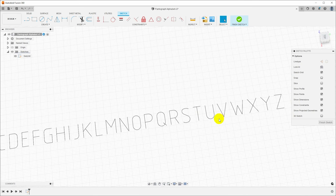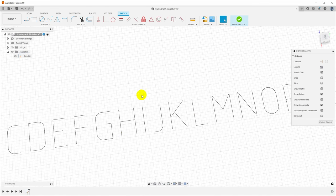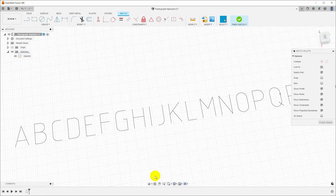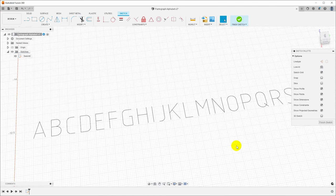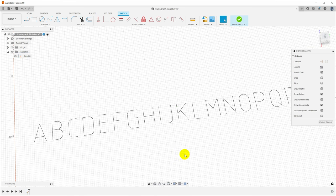Now if we were going to try to compensate for that, we would use a font with proper kerning or a layout engine with proper kerning, but we would have to lay out the letters for the particular words that we want to engrave. In this case, we're going to mix and match the letters, so the best we can do is try to just even up the space between them and create these tiles, because the tiles are going to be rearranged depending on what you're actually trying to engrave. So we will just go ahead and let it lay out, like the I is narrower than the H, let it lay them out that way, and we'll cut them apart into blocks and call it a day. And if you really want something better than that, you're really looking at CNC engraving or making a specific template with just the text that you're trying to engrave.